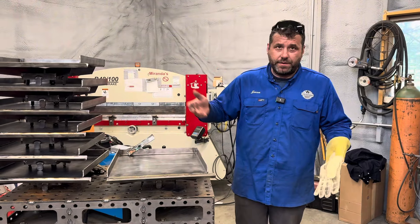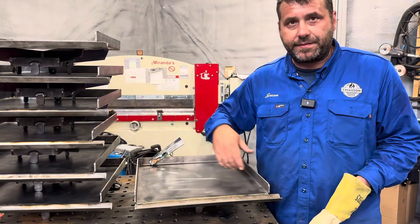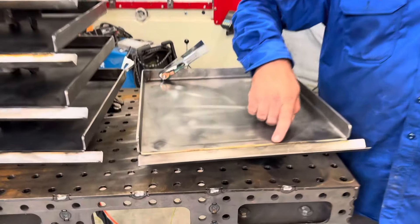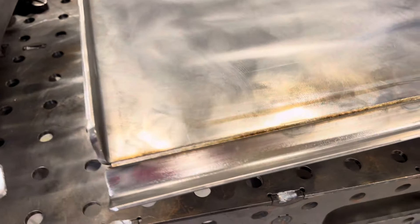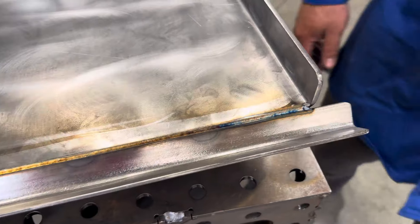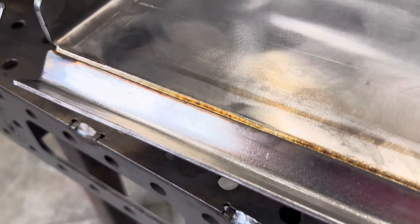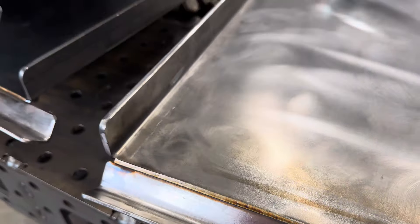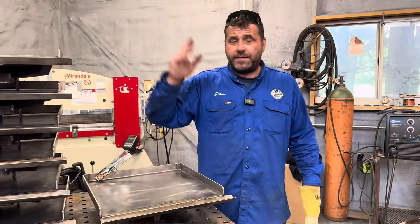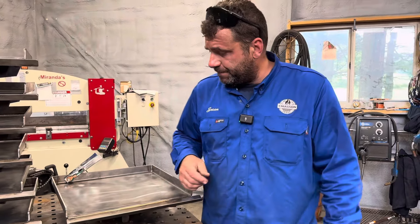That's an example of one of the uses we'll use the laser welder for. It really makes quick work of something like this — just really closes up that seam. No need to grind or do any profiling or anything like that. Makes it pretty quick. Next step we'll get some bottom dies for the press brake and we'll just bend this all in one piece. But for now, this is one way to do it — one of the uses a guy could use the laser welder for.